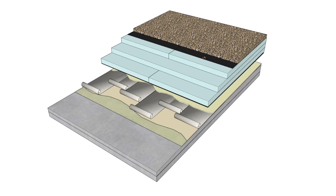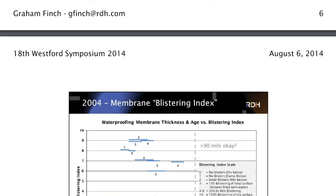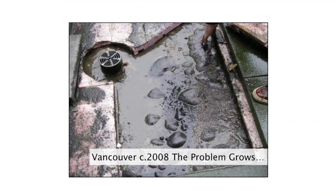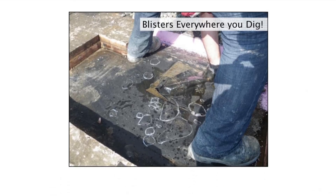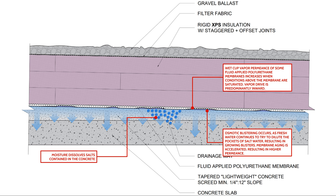Be careful if you're planning to specify a fluid applied membrane on a concrete roof deck. There have been a lot of waterproofing failures with urethane based fluid applied membranes in which large blisters form due to osmotic pressures. Essentially the vapor permeance of the fluid applied urethane membranes increases under wet conditions — also known as wet cup permeance — and since conditions on the exterior side of the membrane are almost always wet, vapor drive is directed inwards. Moisture driven into the concrete roof deck dissolves salt concentrations in the surface of the concrete, and more water accumulates underneath the membrane carrying salts, prematurely aging the membrane — resulting in osmotic blistering.